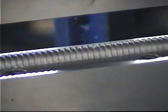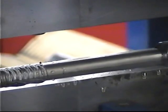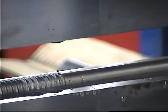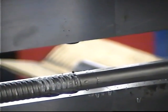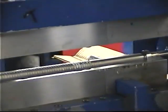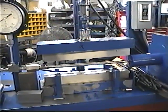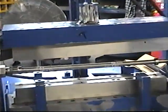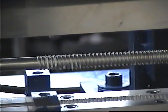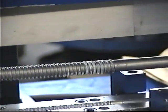This whole forming operation only takes just a couple of seconds. To pressurize it and put all the liquid in probably only takes about 10-15 seconds at the most. The dies are separated and we see the formed tube. The white marks you see there is grease — we put grease on it so that it doesn't stick to the dies.